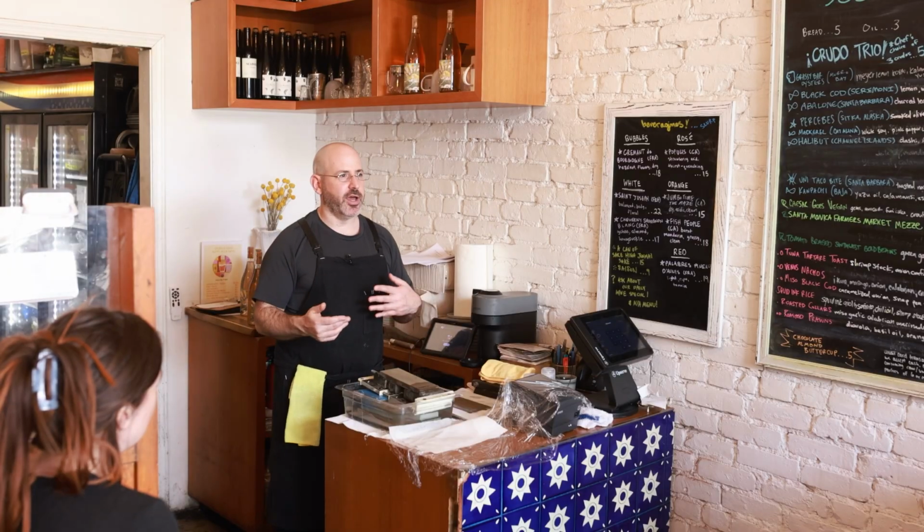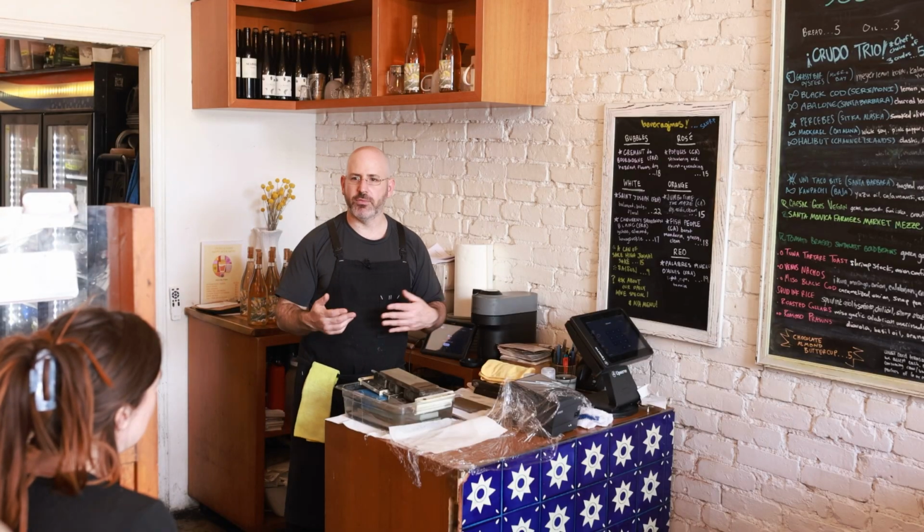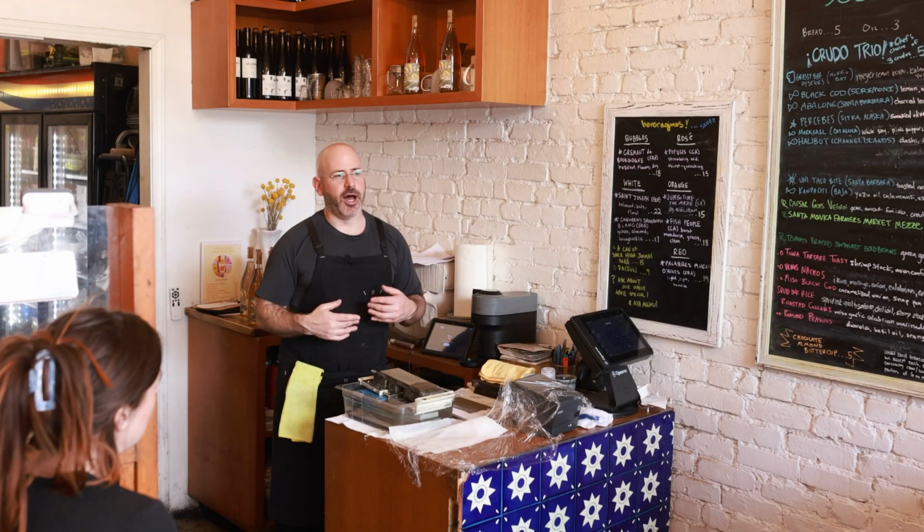It's not slippery. So I like that because we sharpen professionally. People pay us money to do that, so we have to make stuff look nice when we're sharpening for people. And resinoid-based stones will often do a great job at that. I tend to look at them in the more finishing range of things. But the permanent soaking thing can be tricky for some people, and the inability to soak and dry repeatedly is a little bit tricky.